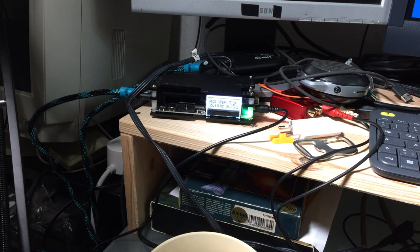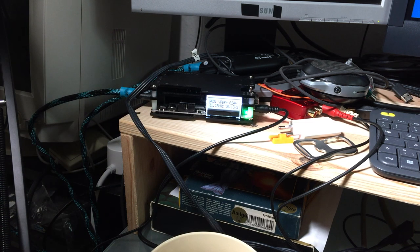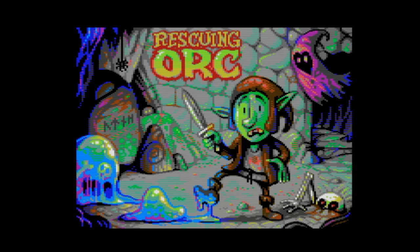One thing I haven't really mentioned yet is that you have this little switch where you can switch different resolutions, basically. Usually this runs on 312p. You can switch it to 624p, which is useful for using it on some TVs, because the picture already gets upscaled by the hardware before it reaches the TV. For use with the OSSC or a good upscaler like this, it isn't necessary. You also have the option to add scan lines, the scanline simulator at 624p.